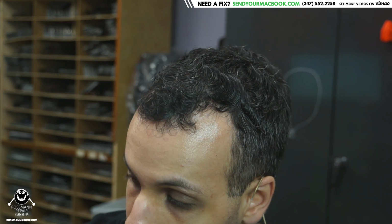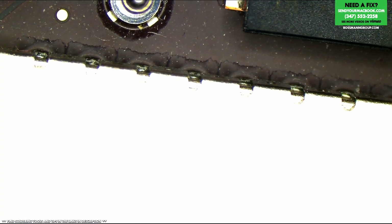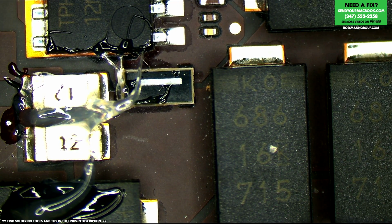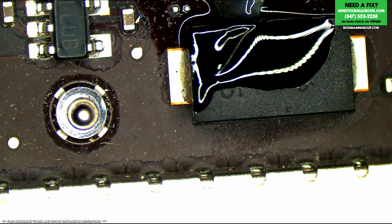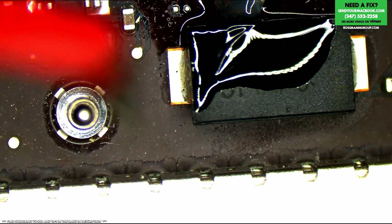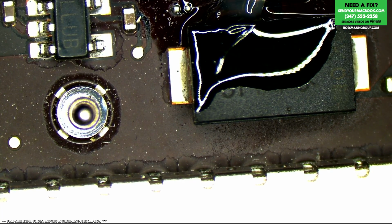So we are going to solder a wire. No, Paul, solder. Solder? We are going to solder a wire to PP bus from our power supply. We're also going to remember to change my power supply from 18 volts to 0.5 volts before I do that, because that would be bad. Now we're just going to solder our wire over there. Doesn't really need to be a perfect joint because this is not something that's going to be permanent anyway. We're going to take our wire and solder that wire to our PP bus. Our PP bus.